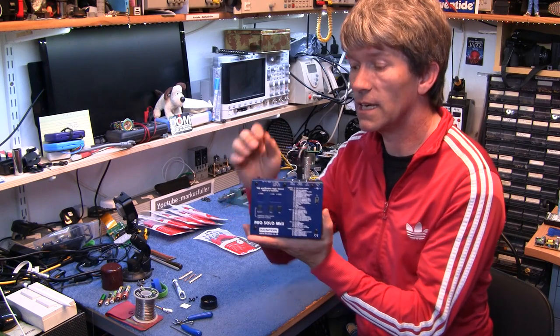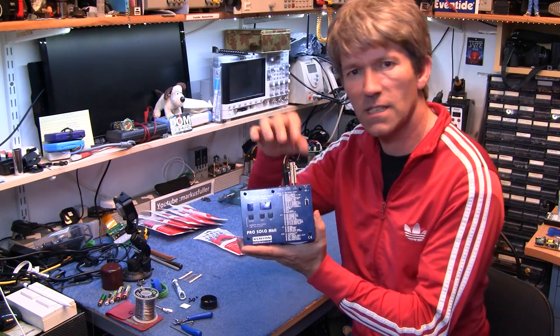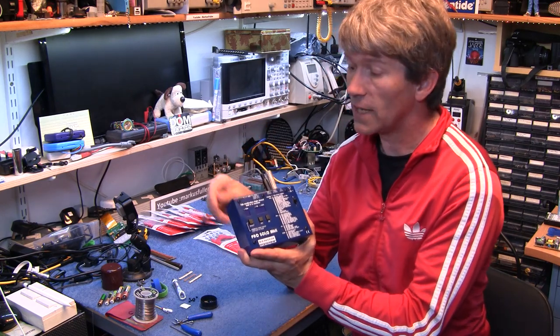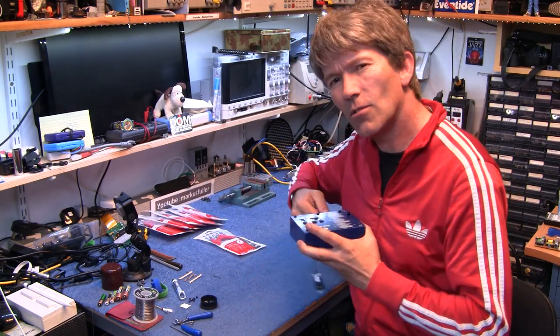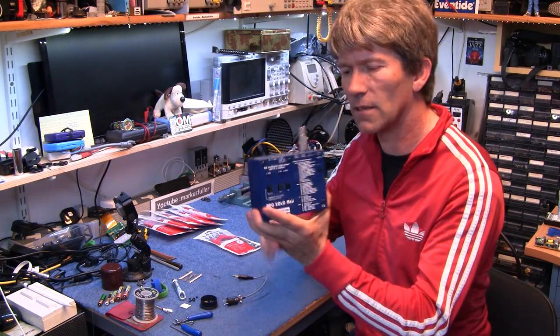Now, what you can buy is one of these little Kenton Pro Solos. And what happens here is you can send MIDI in, and this will split it all up and send it out as a CV in hertz or volts per octave. And also you can choose the sort of gate as well. So you can have S trigger or even V trigger.